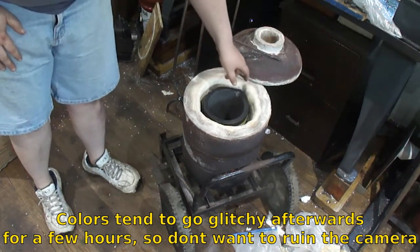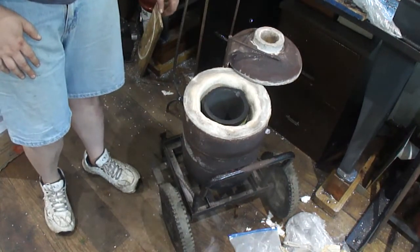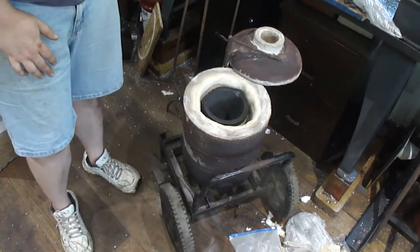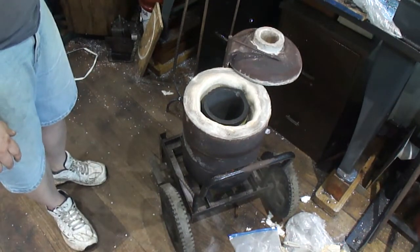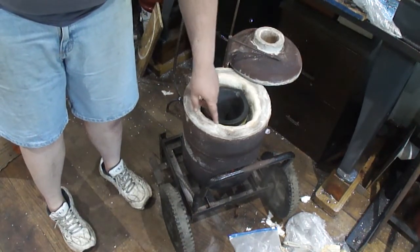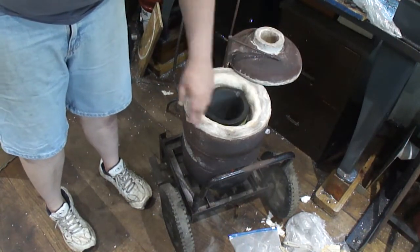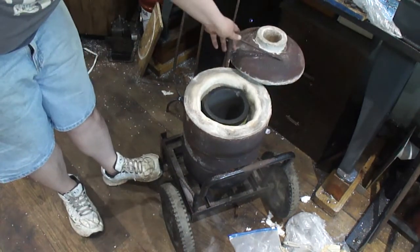It has a little crack right here. I'm not sure why it keeps doing it, but it's not moving or anything. It's nice and flat, and it's meeting the furnace lid real nicely. So if nothing else, it's just cosmetic, really. And I'll just take another coating of the ITC 100, just put on the top. That's all it really needs. But that's ready to go.